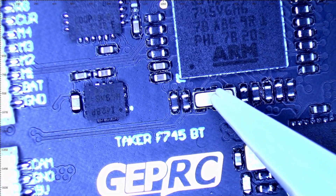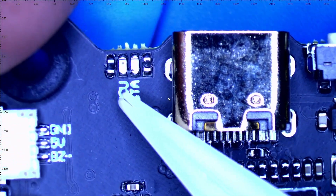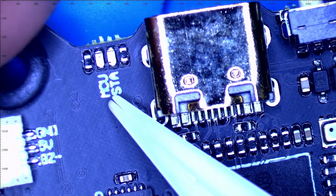We've got an oscillator, our MCU, and our IMUs - we've already gone over those. And then you've got two LEDs - these are your status indicators for the MCU, letting you know what you've got and making sure you have proper current running on that rail. Because these rails matter - if you don't have 3.3V on your MCU, something's wrong. If you don't see that LED light on, you can troubleshoot and find out why it's not working rather than throwing away your board.